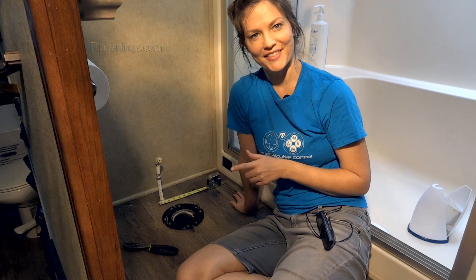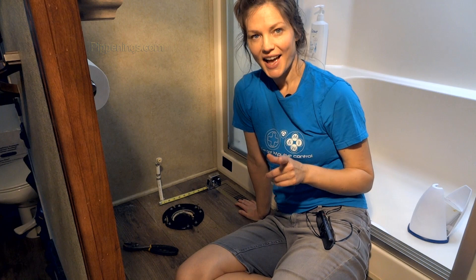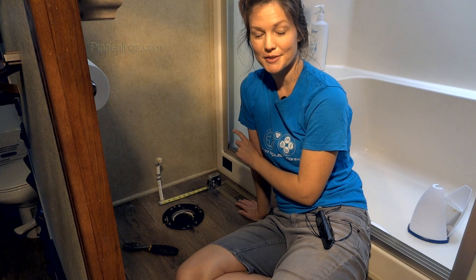Or, what I've always done in the past, I could just cut it off and put a SharkBite on it. And if I do that, I can even get a SharkBite with a valve so that in the future I can turn the water on and off right behind the toilet, which is a lot like you'd find in houses. As this way, I can never have the water turned off right at the toilet. So if I use a SharkBite, I can get that special valve and have that extra feature.